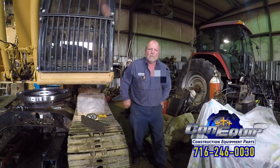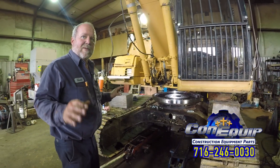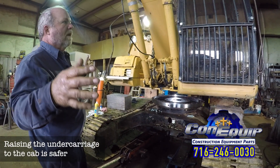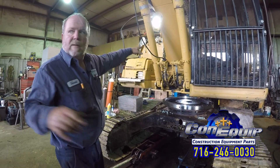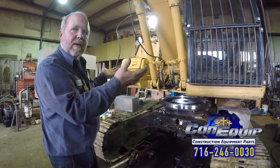Donald, you're moving some stuff around here to get ready to lower it — is that the next plan? No, we're not going to lower the machine; we're going to raise the undercarriage back up to it. This is safer — the machine is so heavy and awkward with no good way to hold it. We'll let the machine support itself with the crane, the stands in the back, and the arm. We let the undercarriage down when we were coming apart, so we're going to ease it back up.